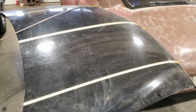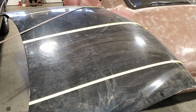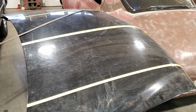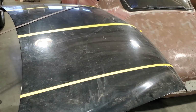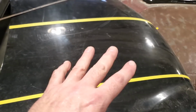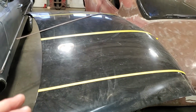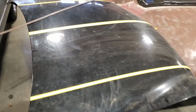It's a squared off panel. There's no panel on a car that is truly flat. It almost looks like it's contoured the other way when it's all made. It's always nice to have a nice crown panel to start with. And this is why I like using all this aftermarket stuff, hoods off other cars and whatever, because the contours are already in it. So when I start folding it up, the center will have a nice graceful flow to the middle of it, right?